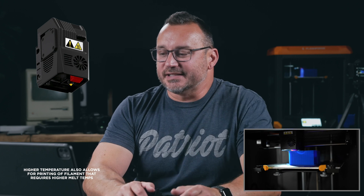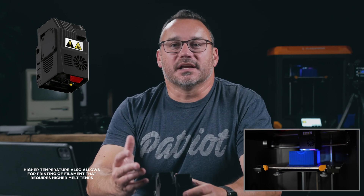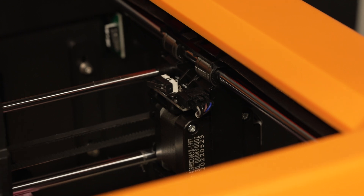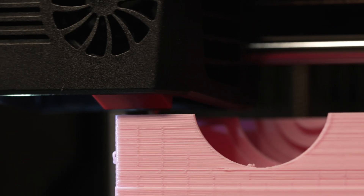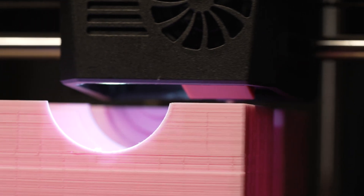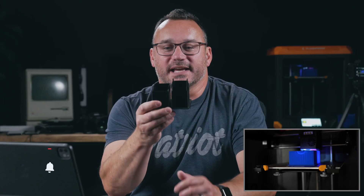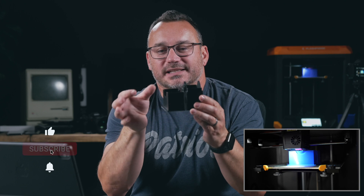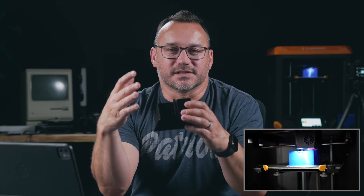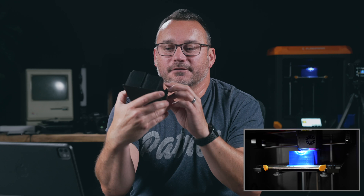The 260 degrees Celsius maximum extruder printing temperature is important because it allows the filament to get hotter and it prints smoother. I've seen rough 3D prints, and while these have a level of texture, it's really smooth. This printer prints fine detail, very clean, and I haven't had any issues that weren't caused by the actual design itself. For example, with this card case, the design had a part tipped on its edge — it's really hard to print something without a surface. I just rotated it on its side and everything has been great.